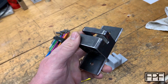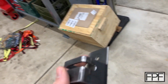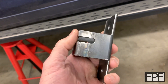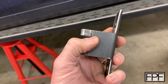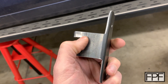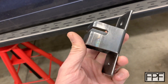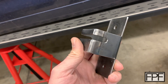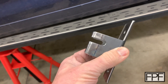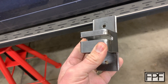Short video today, guys. Full disclosure, I was actually a bit preoccupied with something else — a new toy that arrived today. What kind of was the straw that broke the camel's back: when I was fabricating these, to get this slot cut in here, I drilled a hole here, drilled a hole here, and made two cuts in with a bandsaw down to those holes, then cleaned everything up with a carbide burr and a file. It worked okay, but it was time consuming and not really the easiest way to do it — yet another instance of, wow, if I had a milling machine, I could chuck this up in the vise and just make this slot in one cut with an end mill.